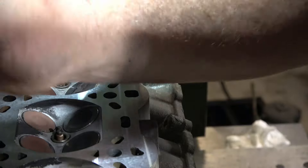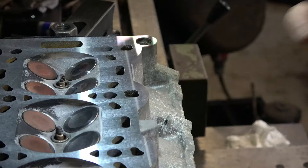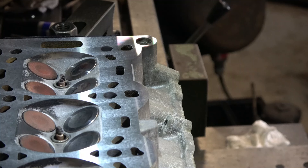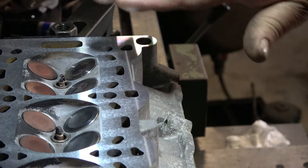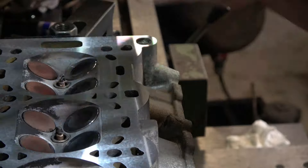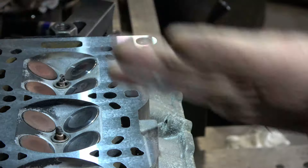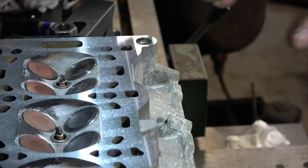That head's done, ready to be collected. It definitely warped in this area. I'd like to address an old wives tale about head warping. Some people seem to think that a head warps like that because they dip in the middle when they skim them. You can clearly see that each end is higher, and they think the whole head warps — it doesn't.